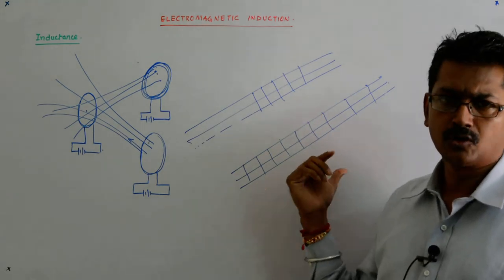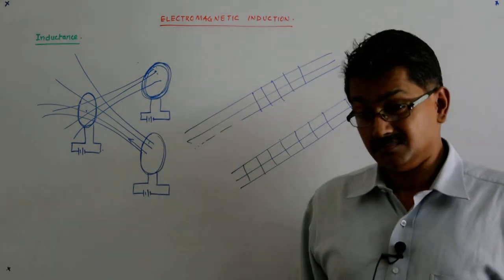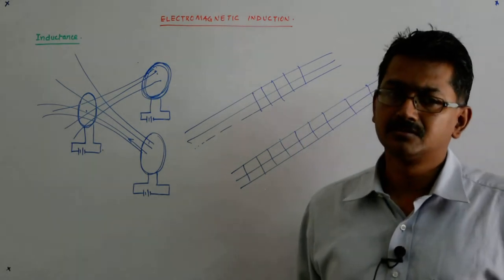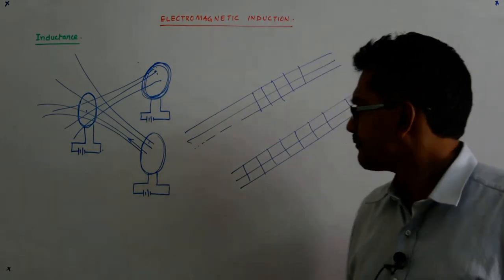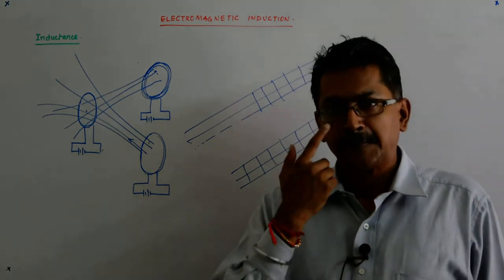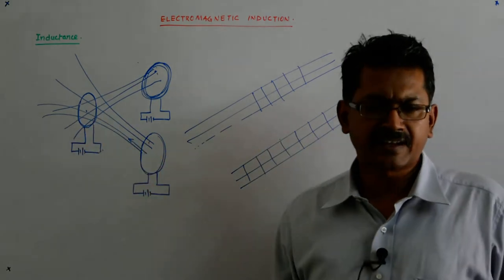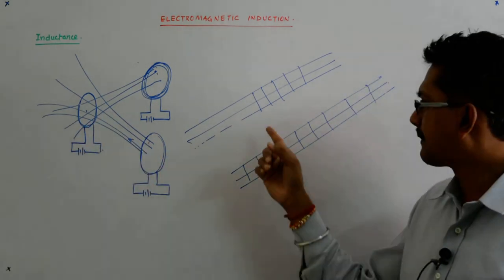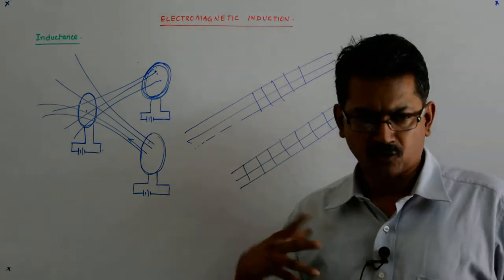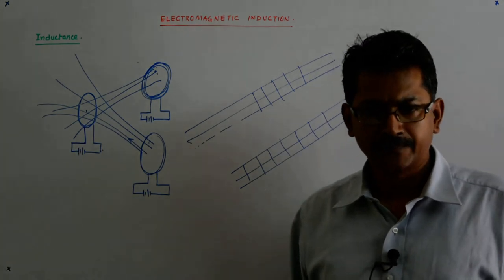Understand? Though calculating it in the scenario of a railway line which may travel on and on for 1500 kilometers becomes a difficult job to do, with obviously varying distances between them at points and varying currents being carried by these circuits. When there are 2, 3, 4, 5 trains, what happens? The current drawn becomes more. So the flux induced in the neighboring circuit also becomes more.